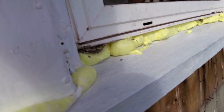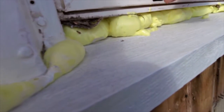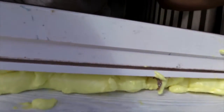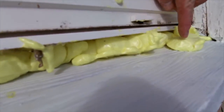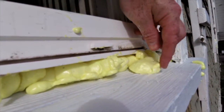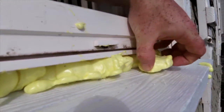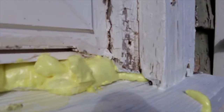I got that in, then I put a coat of primer on the outside, and then I filled with some expanding foam here just to seal the cavity. I have a piece of plastic that covers this up. Once the expanding foam dries - it's nearly dry right now - I'll take my knife and just peel that off. Here's one that peels off already, so I'll peel that off and seal that up.